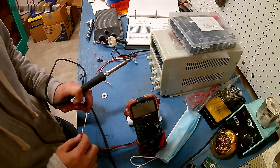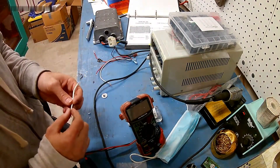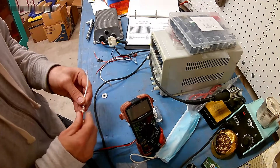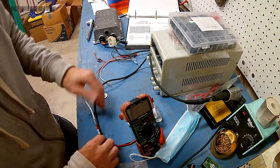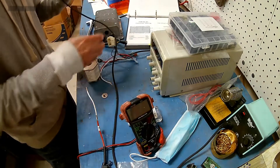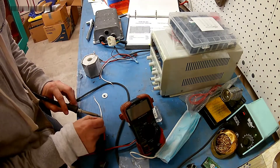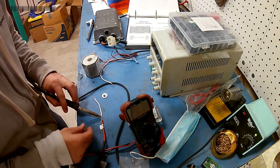The workbench is a mess, but I just want to get this done, so I'm going to solder together these two wires. The purpose is to bring the enable wire to the same length as the primary power wire, and then put those together in a wire loom or something. I don't know how y'all bind wires together, but this is how I do it — thread them together, then twist them. Right here on my wooden bench I just push everything up against the bench. Put a lot of pressure on it. Lots of solder — that ain't ever coming apart.